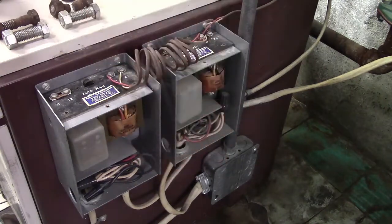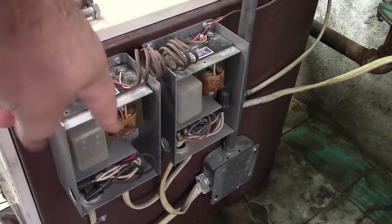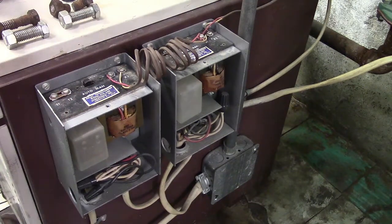The big metal box at the bottom is just an electrical box with AC where the power comes in and then is split amongst these two contactors and runs out to the pumps and all kinds of stuff. These are the contactors for the pumps because the wires run out of that to the pumps. So where the thermostats tie in, I don't know. It's just here, and somehow it works, and that's all that matters. It ties in somewhere in here. I forget exactly how. I think there's 3 wires in this pipe that is running up right to the right of this pipe right here. I think there are 3 wires in there that are regular 14 gauge, like Romex type stuff, a white, black, and a red. And one is one thermostat, the other is the other thermostat, and a common, or neutral, whatever you want to call it.